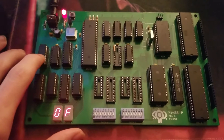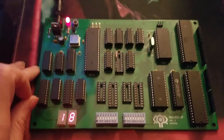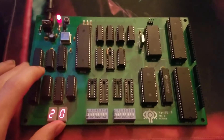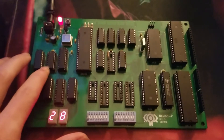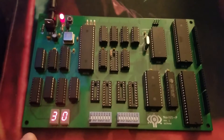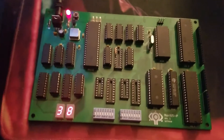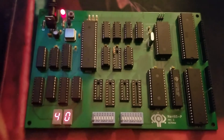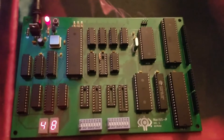This here is a resistor array for pull-ups for the interrupt lines. And this here is, I believe, an 8-line to 3-line priority encoder — something along those lines, no pun intended. And then this is another one of those same registers. Basically what this does is it prioritizes the interrupts and lets the CPU read the register to find out which device triggered the interrupt. I found that on 6502.org and thought it was simple and neat, so why not? With this you can use a jump table instead of polling in your interrupt handler. Pretty neat.